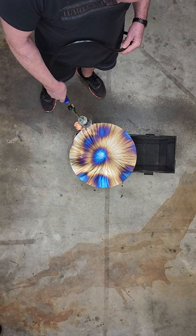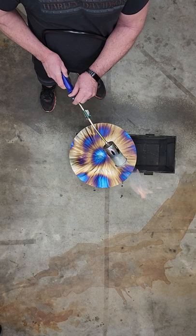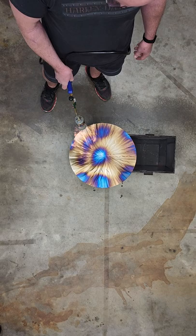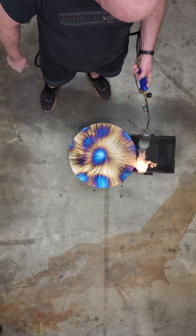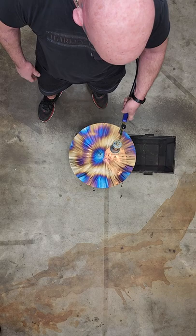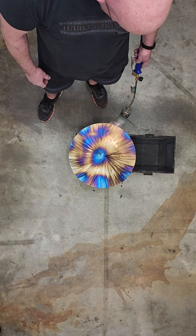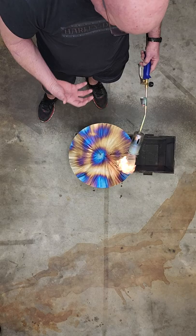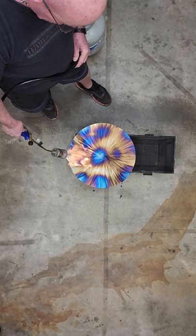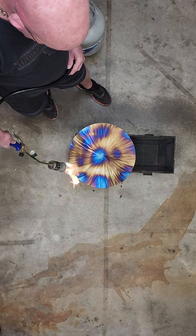Since this is 18-gauge, it's fairly thin, so I'll back my temperature down a little bit. Like I said, the slower heat just seems to bring out more vibrant colors. I've done it all different ways — I've done hundreds of pieces. On some pieces I've just roasted it from the very get-go, and it'll give you kind of that gunmetal color if you're looking for it, and that's fine if that's the outcome you want. But other than that, you just come in here and slowly work it around. Get your edge, and once it starts heating up things happen fast, so you can't stay on it as long. It moves fast on you — I've got a very low flame here, relatively low compared to a standard torch setup, but you get some cool effects from the edge.